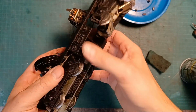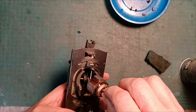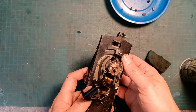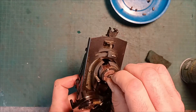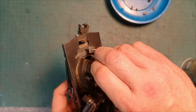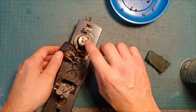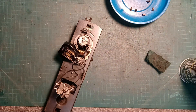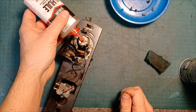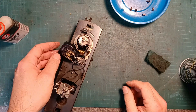We've got all the penetrating oil soaking in there and the gears all greased up, everything's looking good. I'm going to drop this assembly back in. To get it to fit in and engage with the gears, you just kind of spin the wheels a little bit and everything will line up, then down it goes. Also, I'm going to put a little drop of oil and let it run down this shaft onto this washer, because that runs along in there. A lot of you guys probably have sewing machine oil or three-in-one oil — that's perfectly fine.